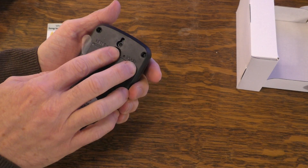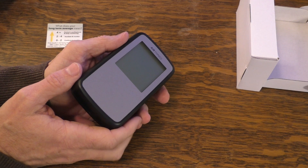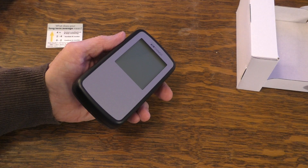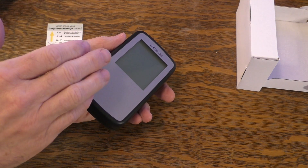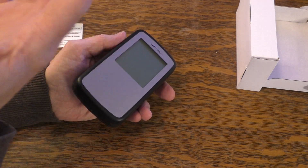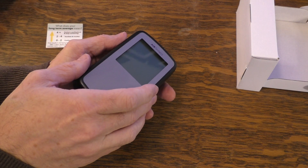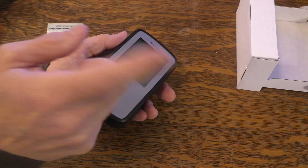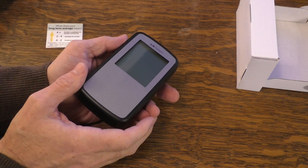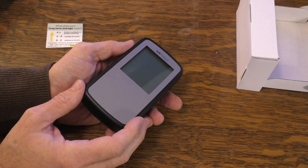I'm in an area of potential high radon concentrations and I'm concerned about my basement. I don't really have living area in my basement, but I do have a furnace down there. Anytime you have a furnace, you could get high levels of radon in a basement. Radon is about seven times heavier than air and tends to sink, but air circulation can easily bring it up into living areas — especially a forced air furnace like I have could draw radon up into living areas. I want to use this device in a couple of places in my basement and also on the first floor to see if concentrations differ.